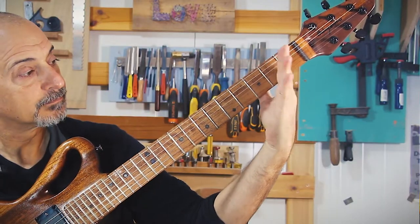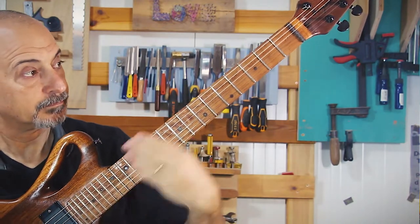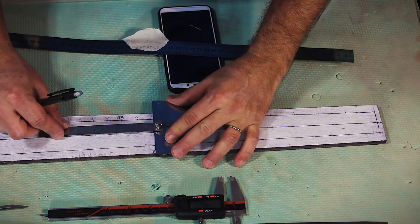Once both measurements are marked, it's time to decide on where the neutral or straight fret is going to be. There's no hard and fast rule here, but it should be somewhere in the middle to not make any of the extremes uncomfortable to play. If you're making the guitar for a specific person, you may want to consider how they hold the guitar, which may change the angle of their hands — a guitar held high like classic Spanish players may require a very different angle than someone who plays it hung down low. After playing around with it, I decide to go with fret number 10. I use a straight angle ruler to mark the position on the high E string, directly opposite the low E. This is my point of reference for this string.